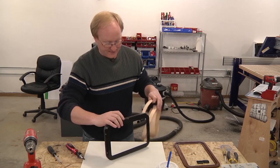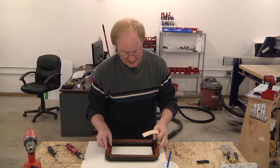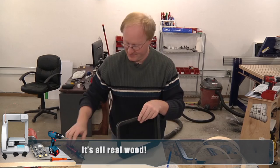Like that. But I have to do it a certain way. I have to actually bolt this together, then put the oak veneer down, then cut it, then glue it to this. I have to do it in that fashion because otherwise I can't keep the gap consistent. So yeah, you kind of have to put it together partially in order to take it apart and finish it, if that makes any sense.